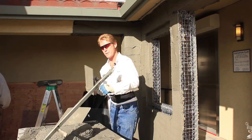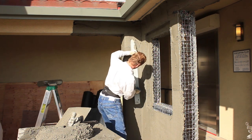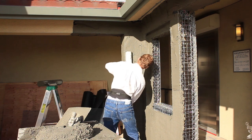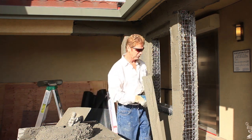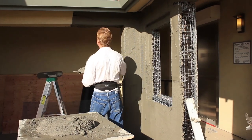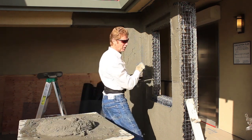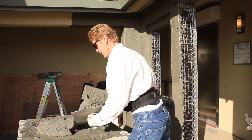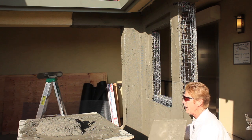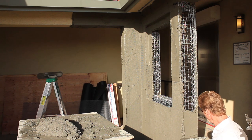Now what I will do is take my handy-dandy rod — pull it this way, pull it that way, that way, that way. That gives me my corner, and I buried up a screed in there — expansion joint, no worries, we can handle that. Lastly, finish up a little bit of stuff in here and then I do this outer corner here, which is piece of cake. I'm just gonna slam this one out — okay, that's done.